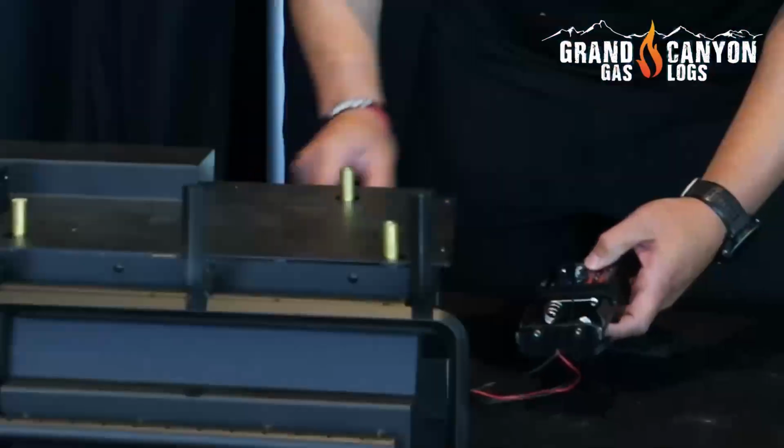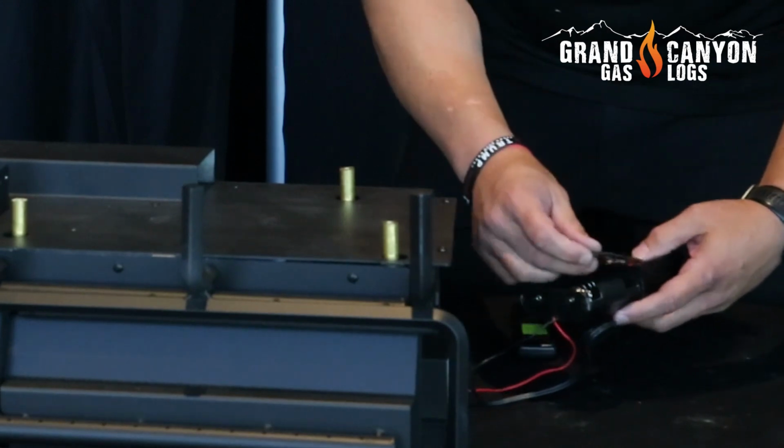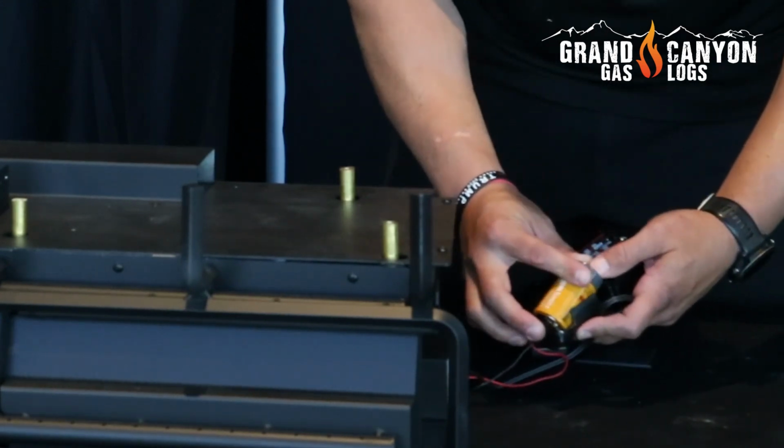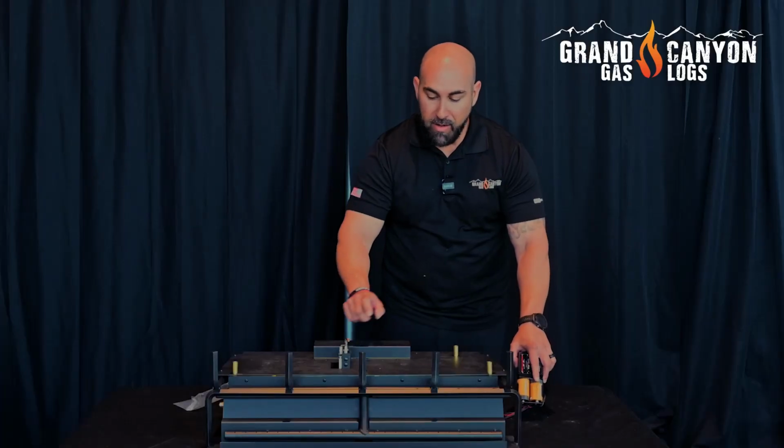Now before we place our media or connect our gas, we want to make sure everything electronically works properly. We place our 2 AAA batteries in our handheld remote, our 4 AA batteries in our receiver, and for this Dexon system, we've also put our 2 D-cell batteries in the battery pack itself. And that's the battery pack that gives the spark on our pilot assembly right here.